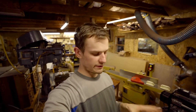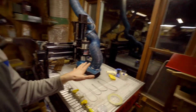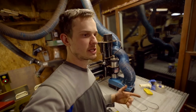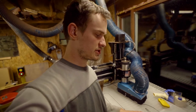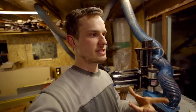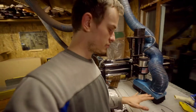It's the end of the day now, everything's kind of wound down and we're getting ready to close up the shop for the night. It's been a good Friday, but once again I didn't make it as far as I wanted to. I do think this vacuum jig is going to be a huge improvement over what we were doing with the double-sided tape. The tape was working, but it was producing some scrap parts, and that's really not good for workflow — it takes a couple of hours sometimes just to set everything up, cut the parts, and go back to what you were doing. This shows promise and testing looks like it's going to work.